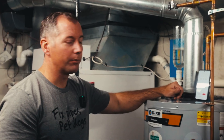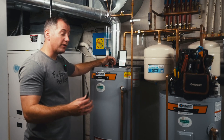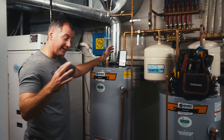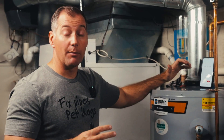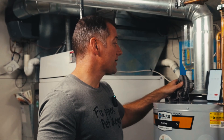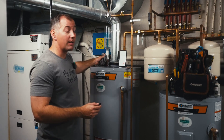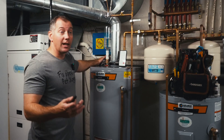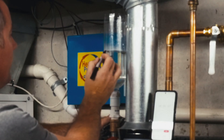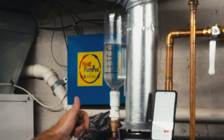The reason the engineers choose that 70-degree temperature rise is that it's the most common temperature rise nationally. On average across the entire nation, incoming water temperature is about 50 degrees and most water heaters are set to 120°F. Here in the Midwest, incoming water in summer might be 60 degrees and in winter might be down to 40 degrees. If you live in Arizona or a desert climate, your cold water is actually really warm because water lines aren't buried very deep, so their cold water is surprisingly warm.